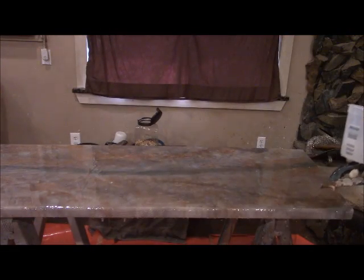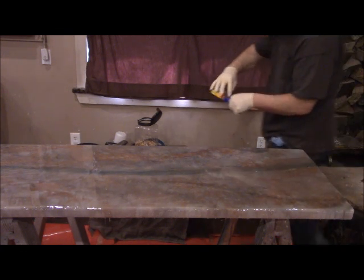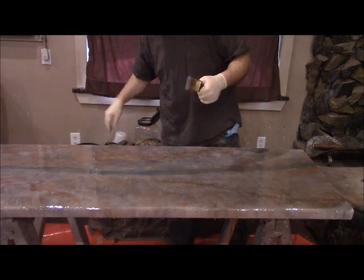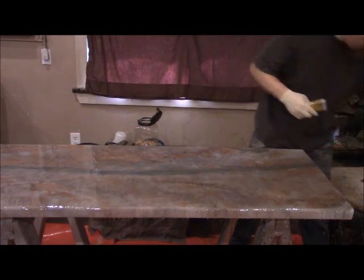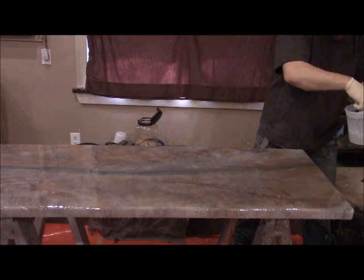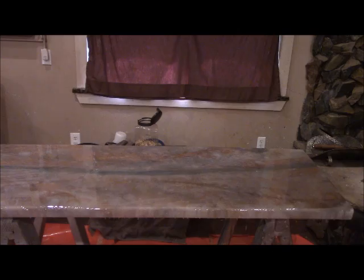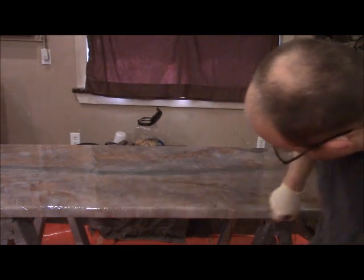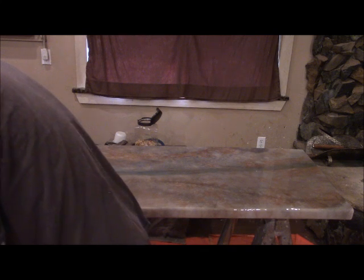That top is now coated and clear. Next step: I've got my little brush — these are one-time use. I pull the excess bristles off and prime the brush first by dipping it into a little bit of material, so that when I start doing the edges I'm spreading material rather than removing it. You're going to have drip marks on the front edges, so go ahead and brush out those front edges a couple of times.